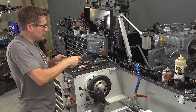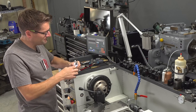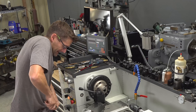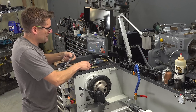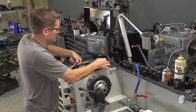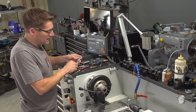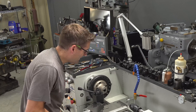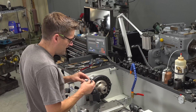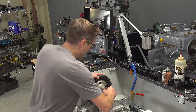The first thing we need to do is take a 3/4-inch wrench — this is just for Hornady dies, which I'm using here — and remove the decapping rod. This uses the zip spindle, so I'll quickly remove that, then remove the lock ring. I've got a 7/8 collet here — this is a 5C collet and a 5C collet chuck, a very handy thing to have for your lathe.